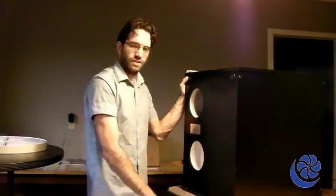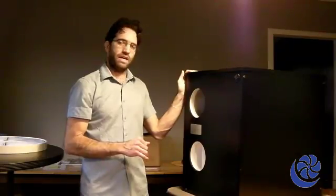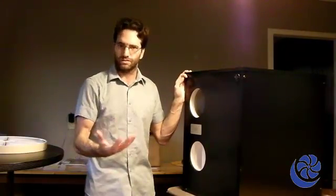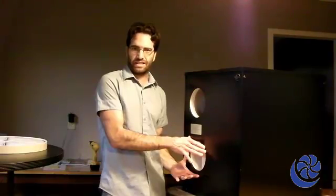The inside connection to an existing forced air system, there are a number of different ways we can do this. One being, we can take stale air from the return of your forced air system from this duct. So this duct gets connected into the stale air or return side of your existing forced air system. This fresh air supply can also get connected into that same return duct. The fresh air duct would get installed closer to your air handler, closer to your furnace. The stale air removal, farther upstream of it.